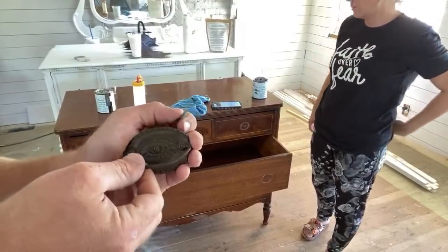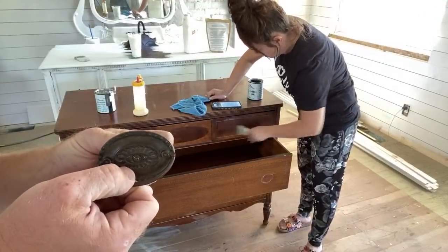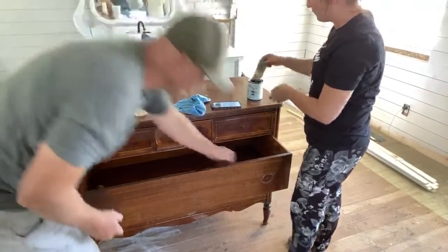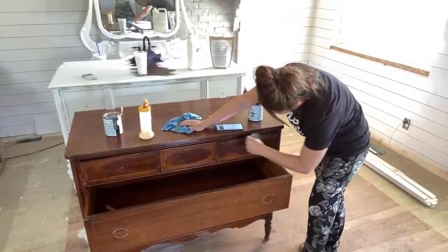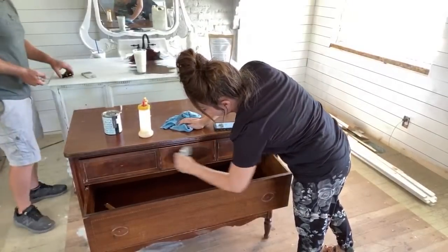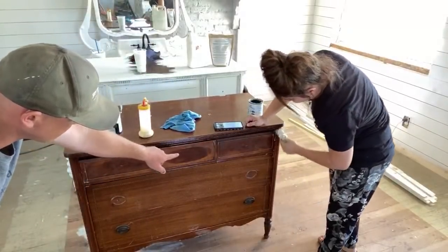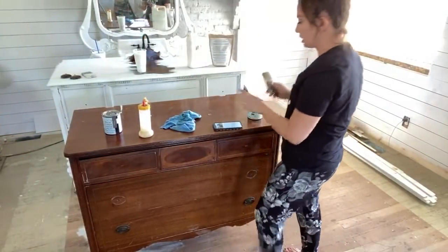This hardware is actually pretty old. And I'm just priming this because it's mahogany - this is like furniture 101. If you have something with mahogany or cherry, we used to use shellac to keep it from bleeding, but shellac will give you a headache and you can't do it inside the house. It's not water-based so you either have to buy a spray can, and if you brush it on you've got to use special cleaner. This primer is nice because you can do it inside without a mask. You can see the mahogany is actually changing the color of the primer before it dries.